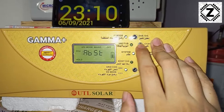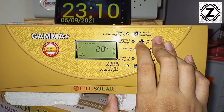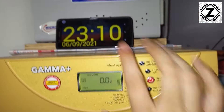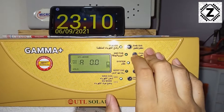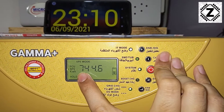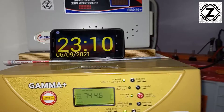The mains is off. Scrolling forward, this is the battery voltage — no charging available. The load is at 28%, running exclusively from batteries at this point. The SPV, that is solar panel voltage, is zero because we don't have sunlight at 11pm at night. Going further, zero amperes from the solar panels. And this is the kWh reading which we'll have to memorize.